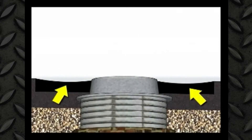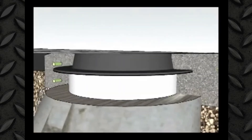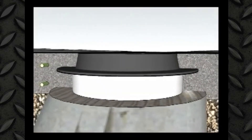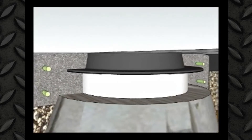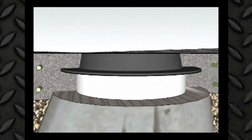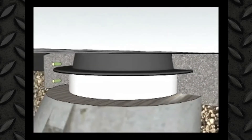Ready-mix concrete really is a good option for these repairs. The worst case scenario — they just look more like asphalt. Cupping and mounding can occur with asphalt: there will either be too much material placed in initially and it can't be rolled flat, or traffic loading can push the material down and you'll get a cupping. This does not occur with ready-mix concrete. Our design objective is to remove the many horizontal joints in the traditional chimney structure. With ready-mix concrete, we can achieve a one-piece repair and eliminate possible leakage or structural weaknesses.